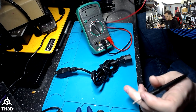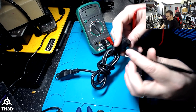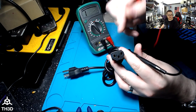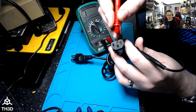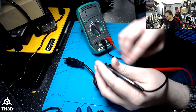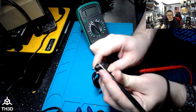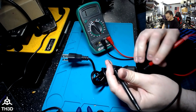Now we're going to test the cable that could give us problems and could kill us if we have an electrical issue. This one also has labels: line, neutral, and earth, and you can see there are metal contacts in the plug. I'm putting the probe in here and touching across — and there's nothing. Absolutely no reading. Let's go ahead and test the other two pins — those will probably work, and they do.